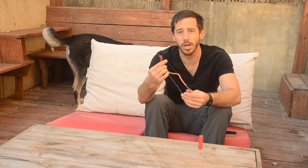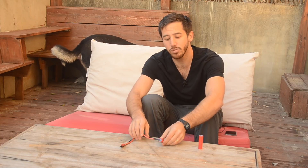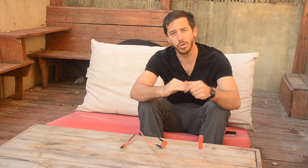On the other end I just have some Anderson power pole connectors. Now I'm going to be doing this test with a resistive power load, which means that the current is actually going to slowly change based on the voltage. So as the voltage of the battery drops a little bit over the discharge cycle, the current is also going to drop a little bit.